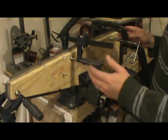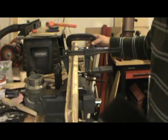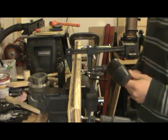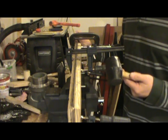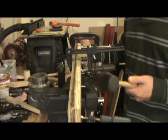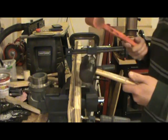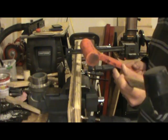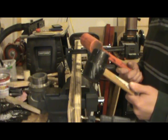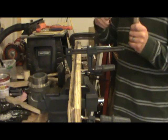I've got these clamps strategically placed where the material is going to want to bend and flex. Now I'll show you how you actually hammer the part into position. When hammering aluminum you don't want to use anything other than a rubber or plastic-coated mallet. You can use steel, but there's a tendency for steel to get embedded into the aluminum, and you don't want to introduce a dissimilar metal. I use a solid cheap rubber mallet and also a dead blow — both from Harbor Freight. Generally I do 99% of my forming with the cheap rubber mallet.